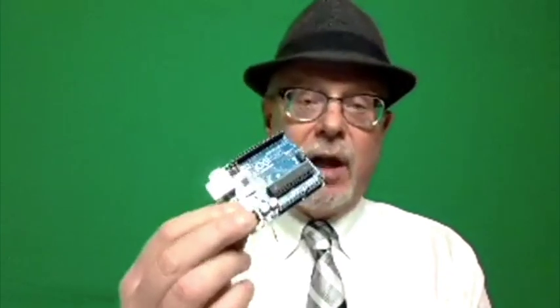Let's talk about the kind of output pins you have. First, let me give you a feeling about how many people have GPIO pins and what they're used for. Here's our famous Raspberry Pi — there's about 20 GPIO pins here, and they operate at 3.3 volts. On an Arduino-type product like the Arduino Uno, you have even more GPIO pins, including the analog pins that can also be used as General Purpose Input-Output. Those two devices are really cool because you can control so many different things.